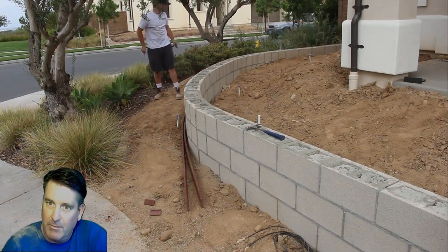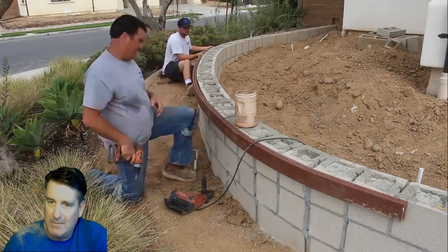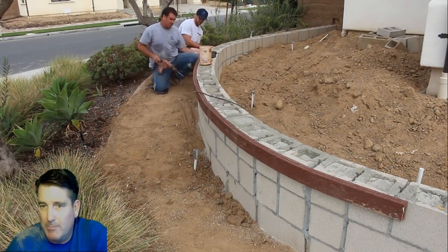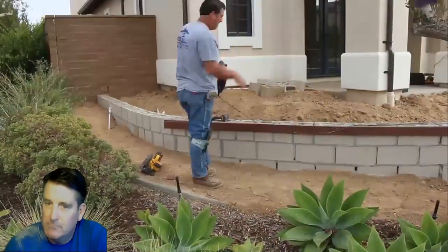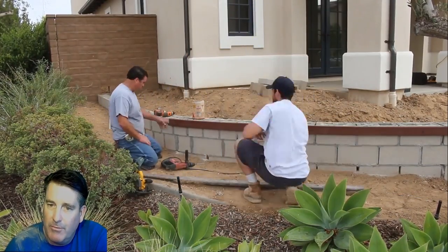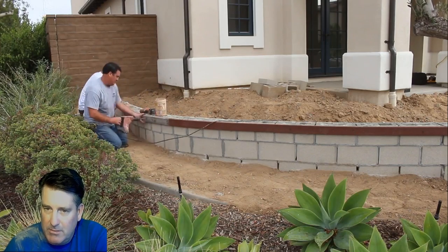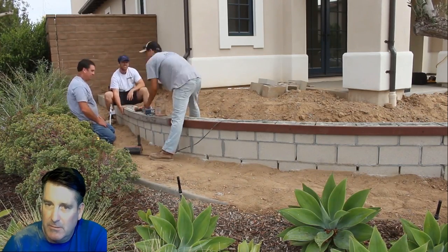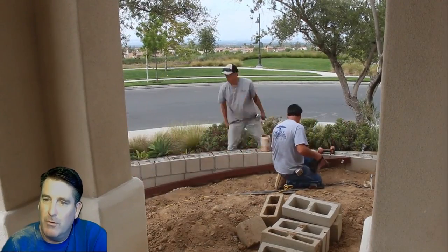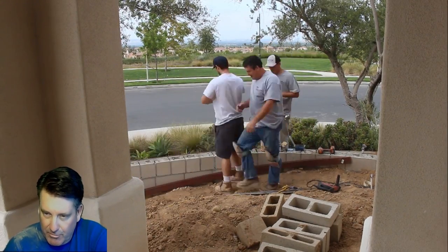Now I've got to clean off a little bit of the excess mortar on the sides of this block because I want to attach my plastic composite recycled material. I'll drill that in again with tap cons — it's all reusable. The only thing that won't be reused is the actual siding. I found some eight-inch siding at Lowe's — it's real flexible — and I'm going to use that to pour against, and it'll attach to this plastic that I'm screwing into the wall.